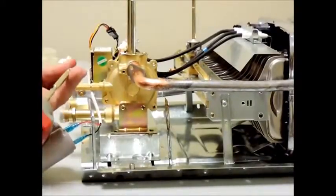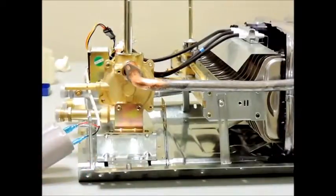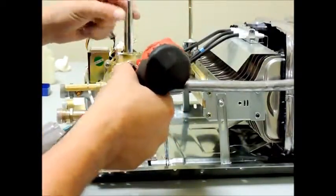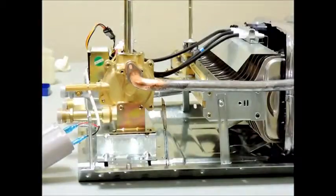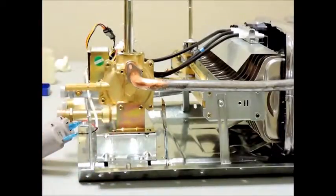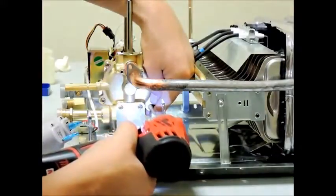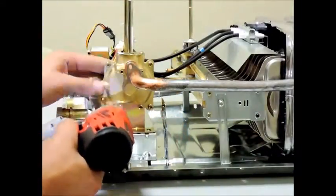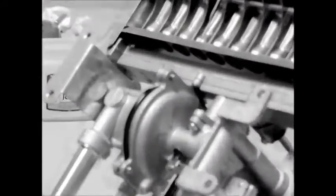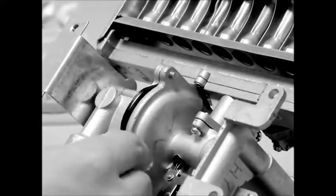If you removed your unit from the wall to work on it, then you will want to start the reassembly by slowly inserting the four housing screws without completely tightening them. Once all screws are in place, then go back and securely tighten them with your drill. Be careful that the diaphragm has not gotten pinched in between the two pieces of the water valve assembly and that it is pushing out the bell housing. If this happens, then loosen the housing screws and re-situate the diaphragm and re-tighten the screws.